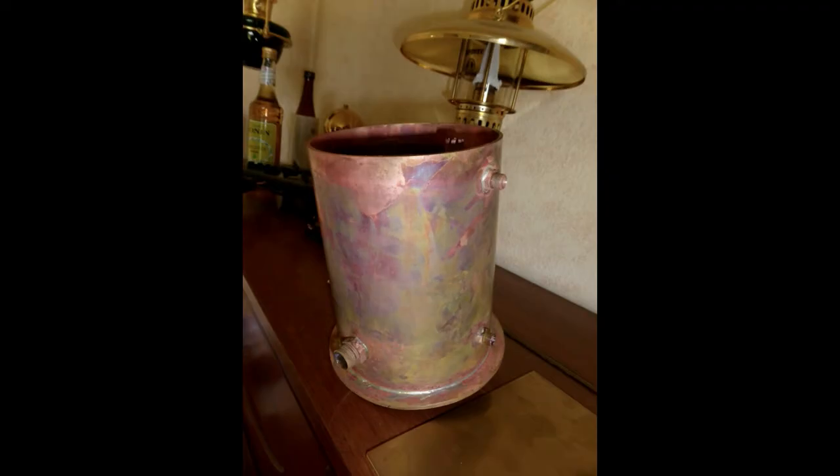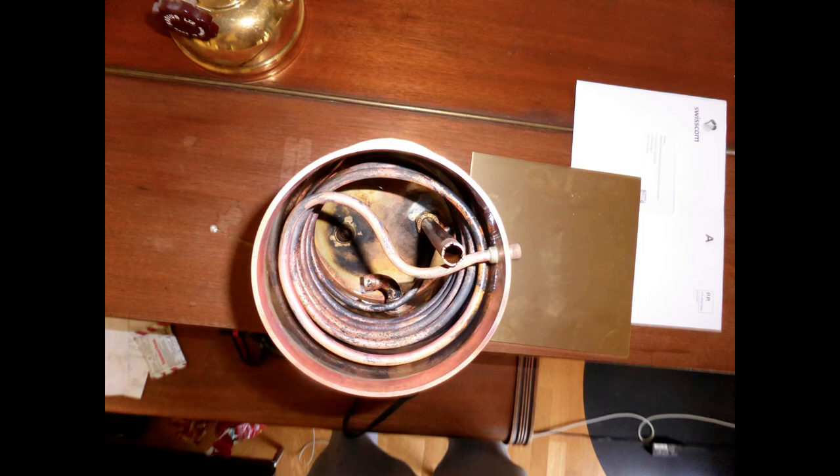On the next picture you can see the brass cylinder which has various input ports and output ports. Looking inside from the bottom, you can see the copper coil which is necessary for the preheating process of the boiler feed water. It comes from the Stuart 5A, as seen on the right side in the last picture, goes through the coil, and leaves it with hot water.